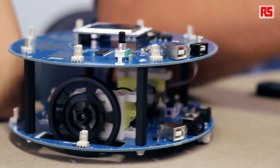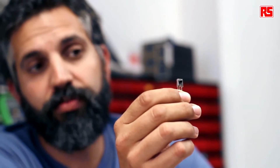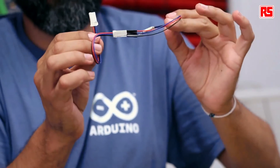We're going to learn now how to use an infrared remote control like this one — a universal remote control — to control the robot at a distance. There is an example you can use for working with the robot using a remote control. You should know that not all remote controls work the same way. Remote controls use a chip like this infrared receiver, similar to those on your TV or stereo. It contains both an infrared receiver and an infrared amplifier, making it very easy to connect directly to a 5-volt microchip like the one that commands the Arduino robot. We recommend you explore the Arduino expansion kit for the robot, which comes with both a compatible sensor and remote control.